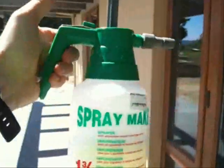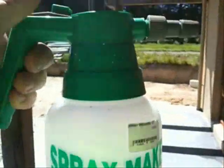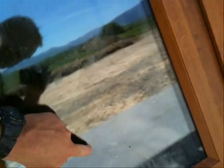What we also use is a pressure sprayer — not just a hand pump, but a pressure sprayer. You've got to foam the product up. I've already applied Liquid Hammer to these windows here and I'm just letting the concrete soften. You might be able to see I can just pull that off at the moment — it's just starting to soften now. See how it's just rubbing off under my finger?